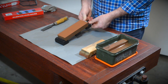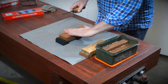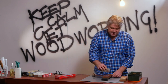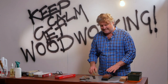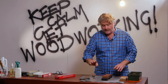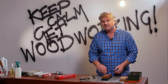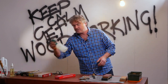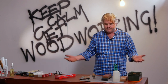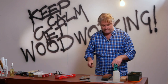I'm just going to pop that in the holder — two little dials, tighten it up and we're good to go. Now this stone's been soaking for an hour or so, so it's pretty much good to go. I like to keep the stones relatively clean. The slurry that's created when using the stone as it wears is critical to the sharpening process, but I like to keep it relatively clean while I'm using it and top up the water on the surface using a little squirty bottle as well. Japanese water stones — you're either all in or don't even bother, if you know what I mean.